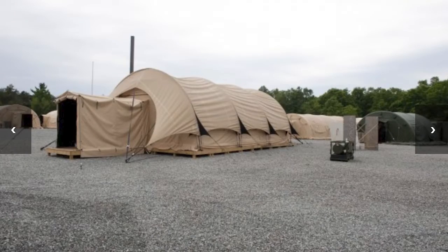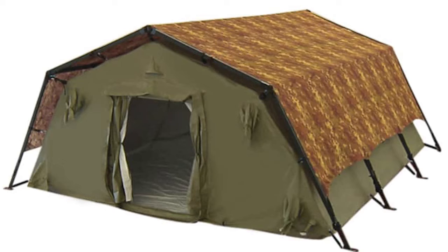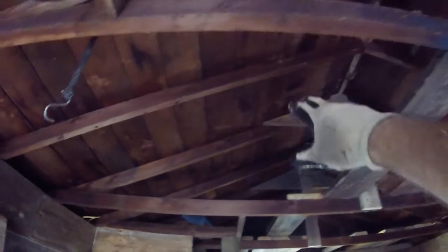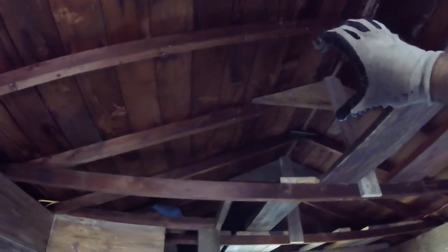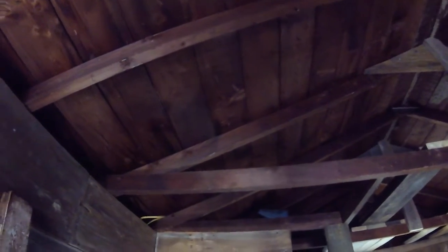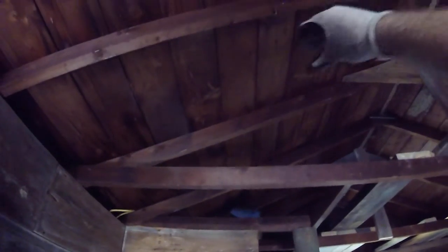And they have that concept with military tents and stuff like that. It's basically putting your roof in the shade, but it's attached to the building itself. With that in mind, I don't have to do a lot of the ventilation that I would normally have to do with insulation. A lot of times you'd have to get at least baffling, so there's a gap between the roof decking and the insulation so that there's some airflow in between there to keep it cool up there.